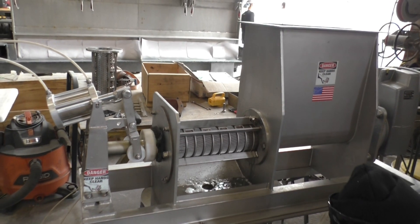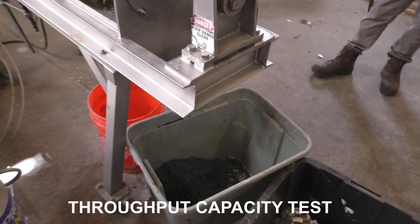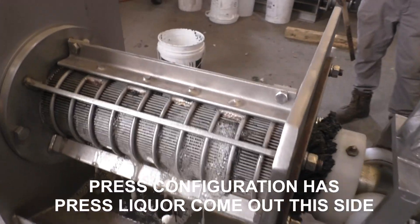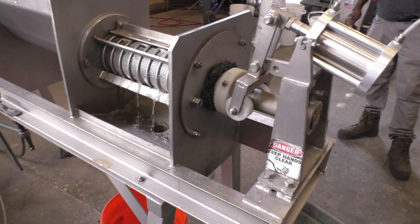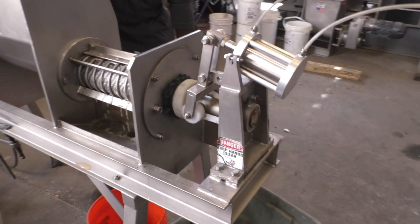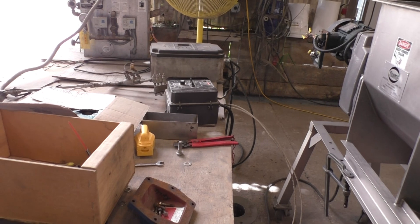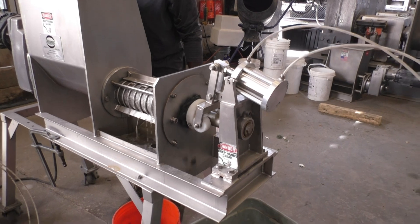The test is going well. Press cake, press liquor — a lot more liquid coming out of this side of the screen because the teeth are on this side. The cone is not very far open. We're at 60 psi and 20 RPM. Normally we have to adjust air pressure and screw RPM, set on a VFD right over here. But one look at this stuff and I knew where to set it — too much experience.